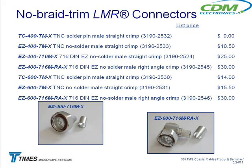We made the back end of the connector a little bit longer so that when you put everything together and bring up the crimp ring, there's no braid left to trim. The challenge getting these into the field is people understanding they don't have to trim the braid, because we've always told people to look for braid sticking out from around the crimp ring as confirmation it's fully seated. Now we have to tell them: on these, you don't want to look for that.